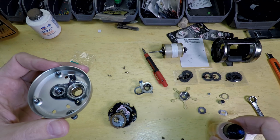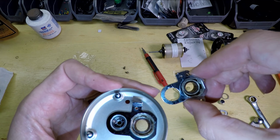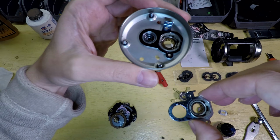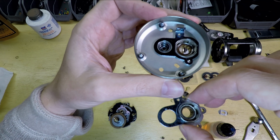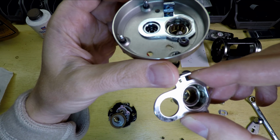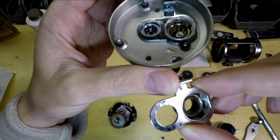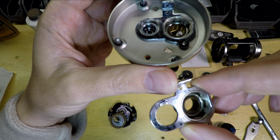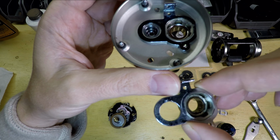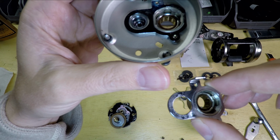Now, the reason this bearing failed, it was full of thick grease, okay? These bearings, you are not supposed to have grease on them, because look at these little cylinders, okay? They're supposed to spin. If you put grease, instead of spinning they start slipping because it's so slippery. And once they start to slip, they develop flat spots, and then once they have flat spots, they don't spin anymore and they begin to click.